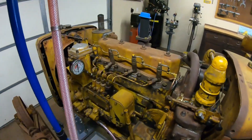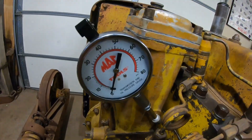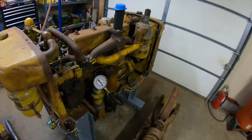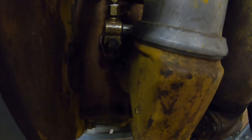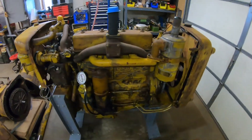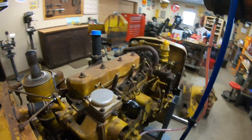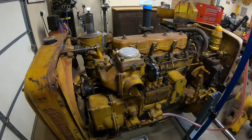A couple of other preps I've gotten done. We've got the low pressure test gauge on the fuel filter housing — that's going to give us our read for fuel pressure. And on the other side, got the higher pressure gauge hooked onto that oil manifold that was leaking last time, so that's going to give us our reading for lube oil pressure. We just need to finish the gravity bleed on this diesel fuel system and we should be pretty well ready to start after that.